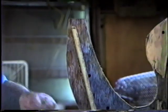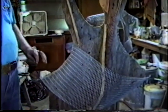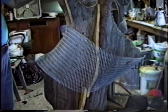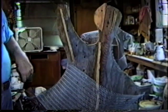So a lot of things are just rough, but all they are just a temporary armature until the metal lath is in place and wired, and then the metal lath is cemented, and then if this were to be a permanent piece, you'd probably fill it with urethane foam. And then if the wood rots, it doesn't make any difference because the cement skin will hold it for a small piece like this. Cement and metal makes a good structure, and then if it's filled with foam or concrete, it would be of little consequence if the wood rotted out, because the wood isn't holding it up.